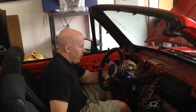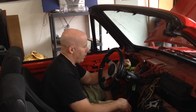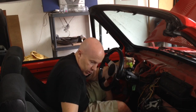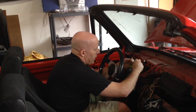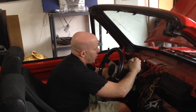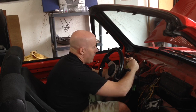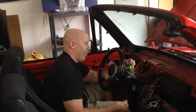What I discovered after doing some research is that — I was going to buy a special tool and I actually ordered one, just a cheap one — but I don't even need it. With just a small screwdriver like what I have here, you can actually just open the back of this up like this. There are two little tabs on the side, and with this open, these wires will just pull out like this and then I can put them into the proper order. There are a couple that are missing, so I'm going to have to wire them in.